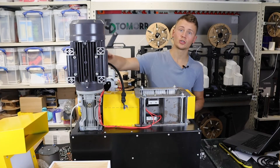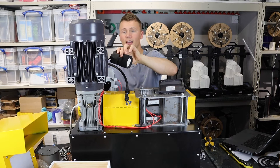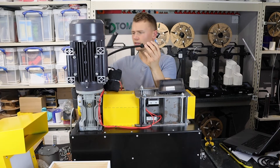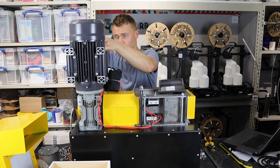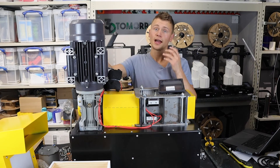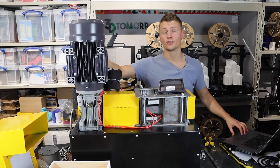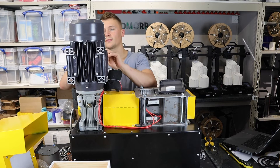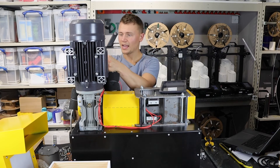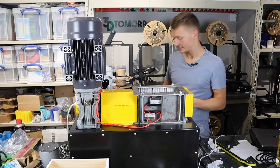Now connect the electronics box to the motor. Undo the screws and take the cover off - there are capacitors on either side that are padded, so leave them padded and hang them out of the way. Push the cabling from the wiring supply down into the top and screw it in. There are bridging connectors inside that span between the two electrical points - these can be discarded. Then wire up the cables to the respective phase points on the gearbox per the Sustainable Design Studio guide. Earth goes to the mounting point at the top (marked with the earth symbol), then: brown - top left, black - top right, grey - middle left, blue - middle right.